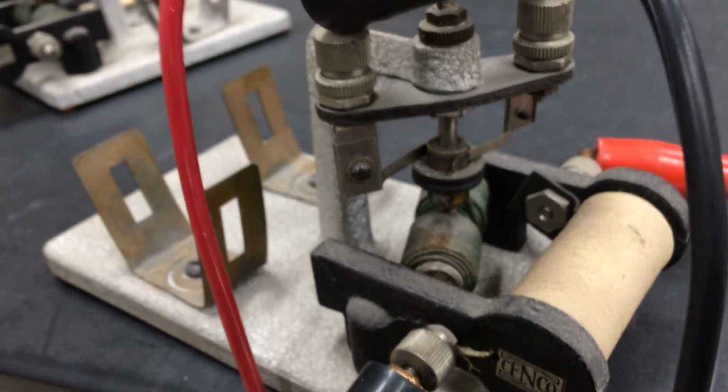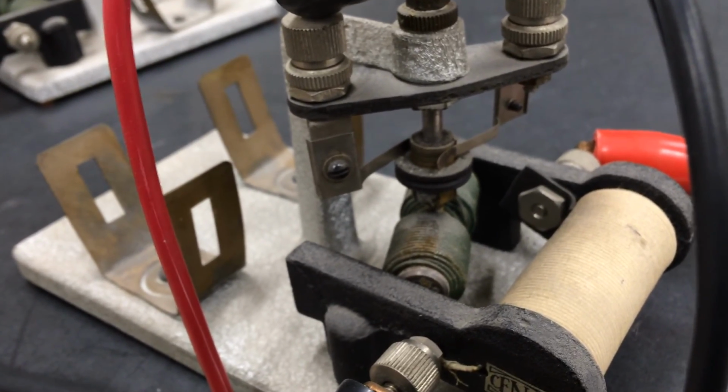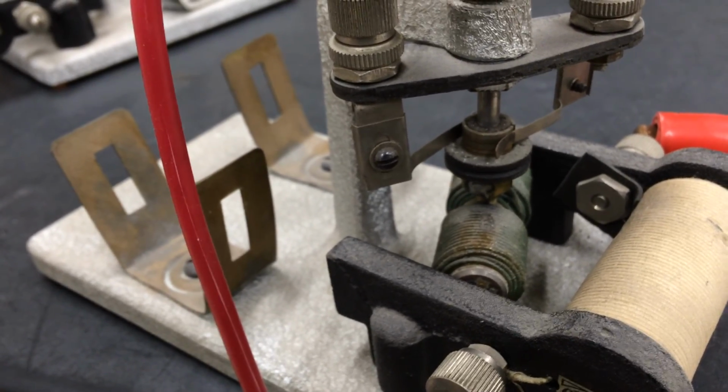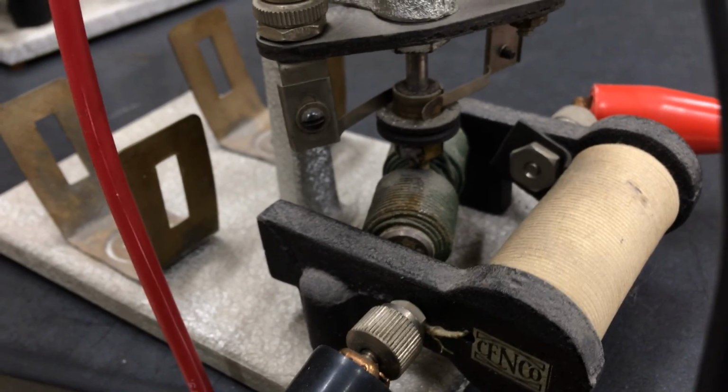And that means that just as the forces change direction on a current carrying wire as it goes in a circle, this is designed to make the current change direction so that the forces are always pointed in the right direction and the motor gets a kick throughout its cycle.